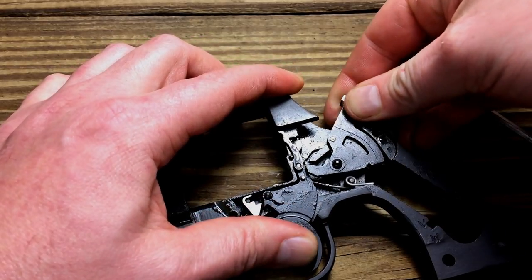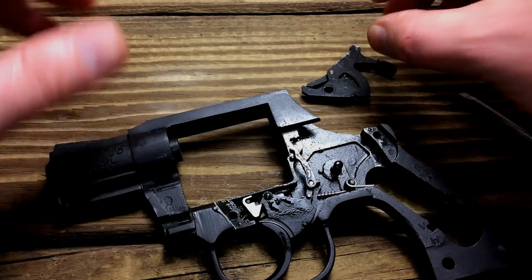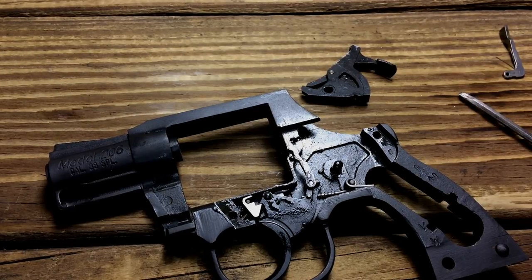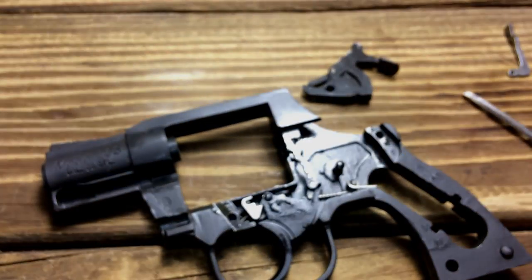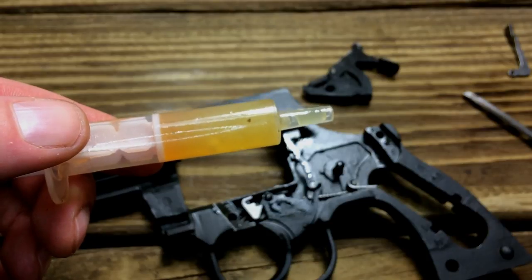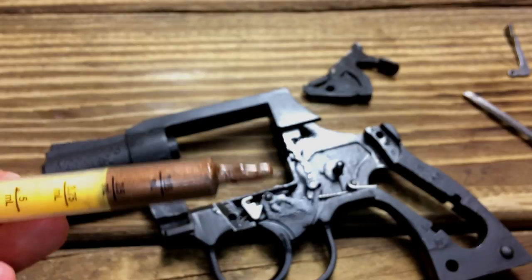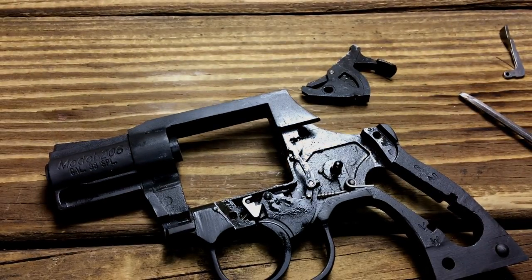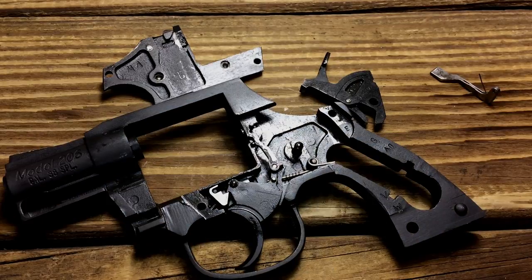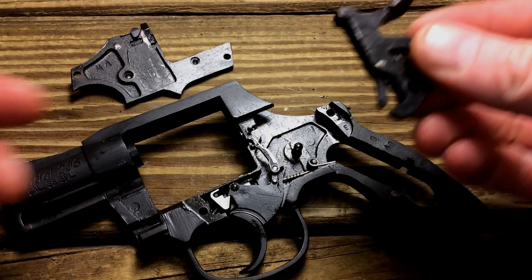Pull the trigger and it should release the hammer. There are two things I'm going to be using: this gun grease here which I've put into an applicator, and also the famous Glock grease — Loctite anti-seize. I'm going to clean this up with some Q-tips to remove some of the Frog Lube and get it ready for the grease, since Frog Lube and regular petroleum don't mix too well.